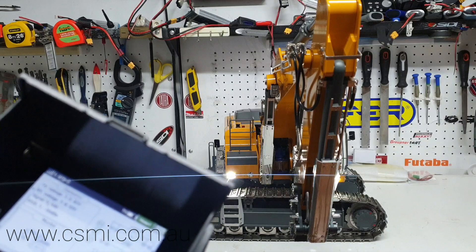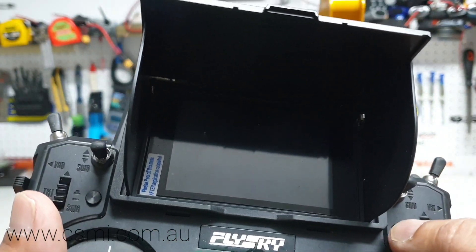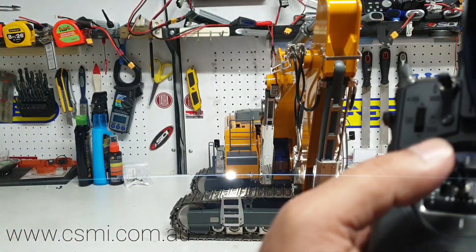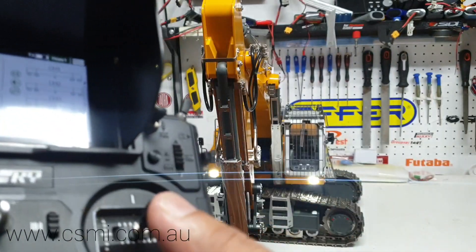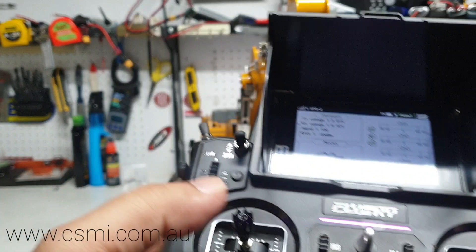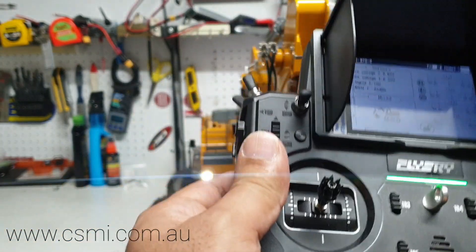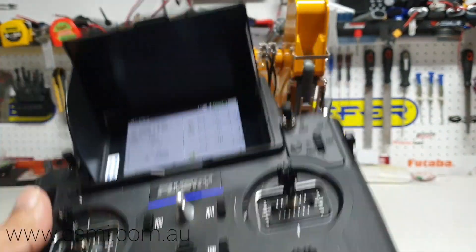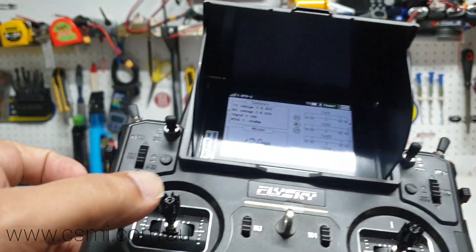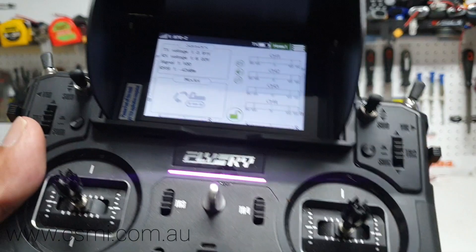There's another little switch up here — if you hit this, it swaps the joysticks to the tracks. I'm going to hit this and increase the sound so you can see the tracks move. Both tracks are on two joysticks, and when you hit this function, it takes control away from the upper carriage and puts it onto the tracks. It's a clean swap and very easy. It's also possible to mix it on this radio so you can do all functions on one particular stick — stay tuned because we'll show that in the next video.